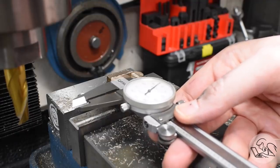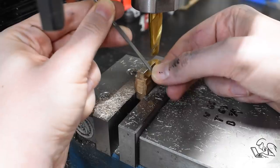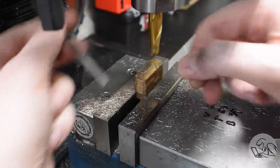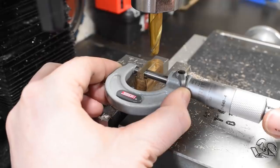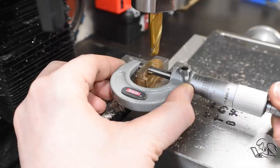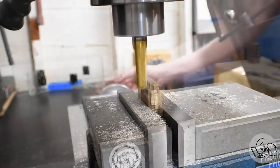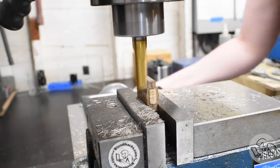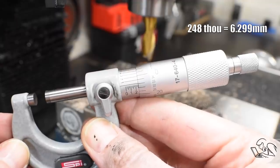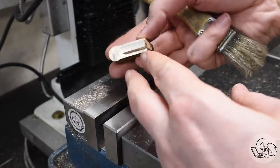As I go I'm checking the depth of the shoulder to make sure the leg is going to end up aesthetically centered on the casting vertically when I'm done. I'm checking in three places to make sure the sides stay parallel. In the end I decided to take the final pass entirely off one side to make sure I end up centered. I'm supposed to be 2 thou under 250, and yeah, we are well within the shenanigans tolerance there. First side done and looking pretty good.